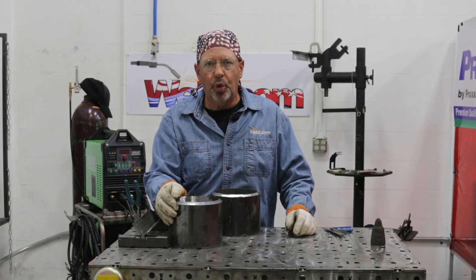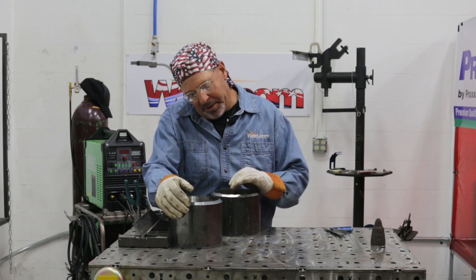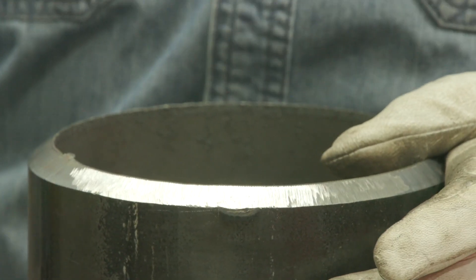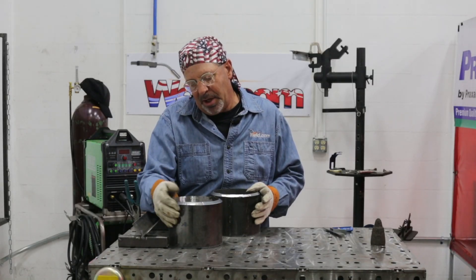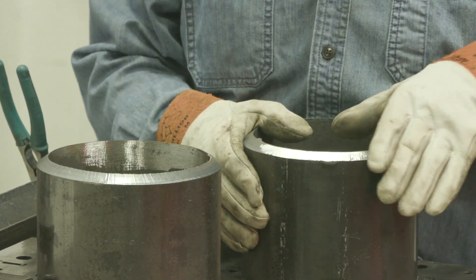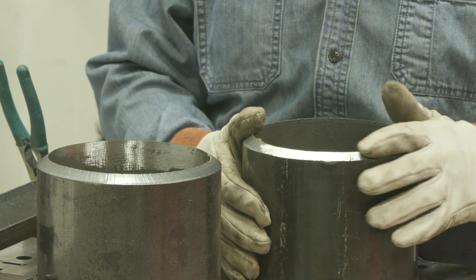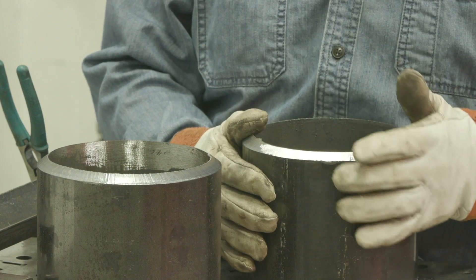We've cleaned up our coupons. I've left the area right here where I did this last one — it had a big flat messed-up knife edge on here, plus the start and stop. Some of these little minor areas where travel speed got bumped — as long as they're clean, you can weld right through them. Since this one had a collapsed knife edge, I wanted to bring it back to a consistent surface, so I built it back up, cleaned it, and repaired it. Both of them went pretty nice.